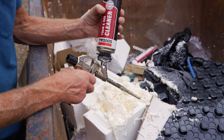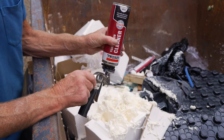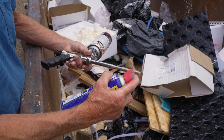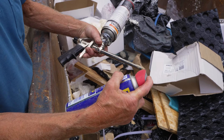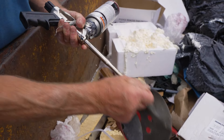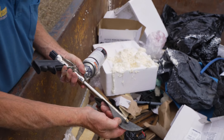The idea is: put it on, give the cleaner time to do its job, and then I'm cleaning up the end with a bit of WD-40. I find this softens the foam up quite nicely, and then you can just give it a very gentle rub at the end — it gets rid of all that and the gun looks as good as new.